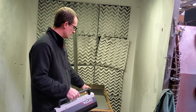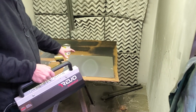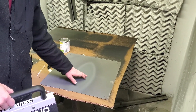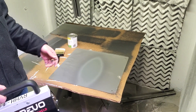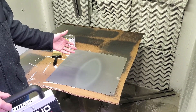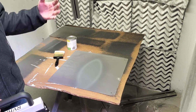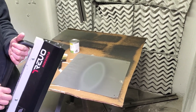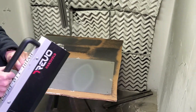However, for a wide flat part like this one here, it's a very ideal solution — it's going to cure fast and efficient. In fact, the powder coat on this middle part here was cured with the lamp in about three to four minutes. Since this is a wide flat surface, it would be well suited for a medium wavelength, primarily with some short wave IR lamp. We'll go ahead and fire up the lamp to show you how that works.